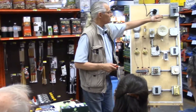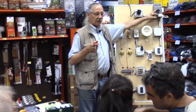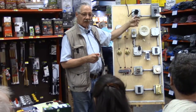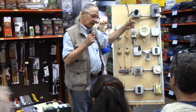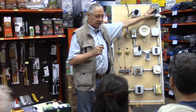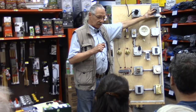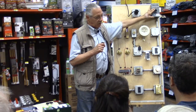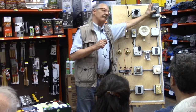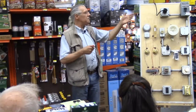You could also test circuit breakers with this. How? Take it out, remove the wiring, hook this to the circuit breaker and click it on and off — it will at least tell you if voltage can pass through the circuit breaker. Now that doesn't load test it — it could still be a weak breaker that on the simplest loads would turn itself off. But just by playing with the circuitry, you're going to know that.